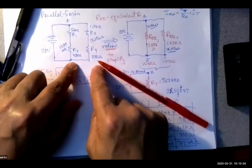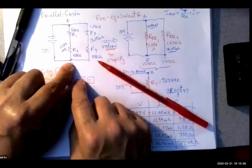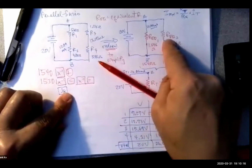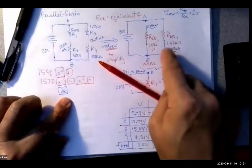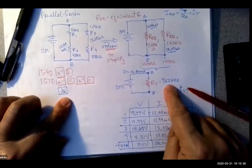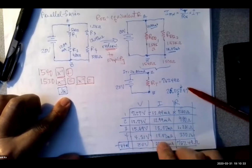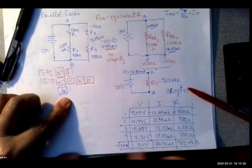If we follow the wire to this node, we see another wire and it has two resistors and they are also in series. So we can combine those two. They become REQ number 1. We reduce the 4 resistors down to 2 resistors. And with 2 resistors, they are easily calculated in parallel for a total resistance of 767.49 ohms. Fill in our chart, find I total, and then do the rest of the analysis. And the voltage is the last thing we do for this particular analysis.